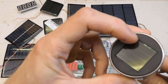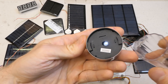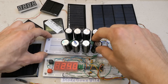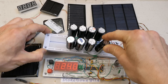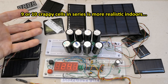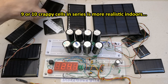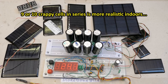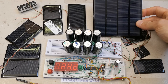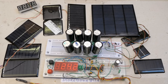For example these solar lights have 4 cells in series and this is charging a single nickel metal hydride cell. I'm using 2.8 volt capacitors but I'm charging them to just 2.5 volts to prolong their life. I'm thinking I need about 7, 8, 9, or 10 cells in series to charge them in low light. You could put two panels in series to get 8 cells in series, but I'm probably going to use this bigger panel — now 2 in parallel and 9 in series.